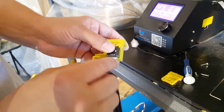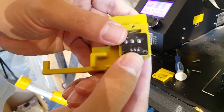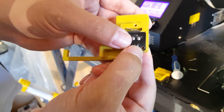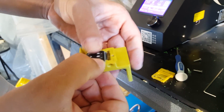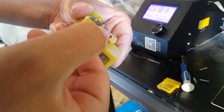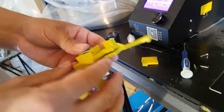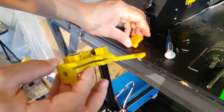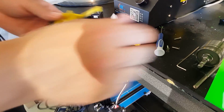What you do is put it in like this, then line up the back two holes visually as best you can, and then just slide it in and press down. If you do this and it goes in properly, you'll have no PCB sticking up above the edge. And once you have this printed, there's one other thing you should do — and you should get this before you start printing — and that's an M3 tap.